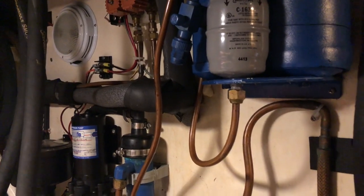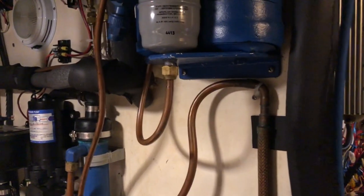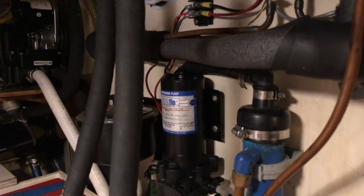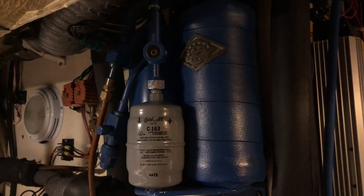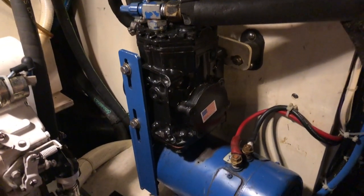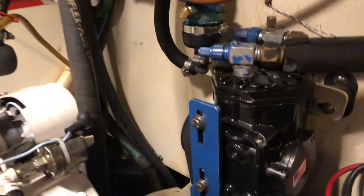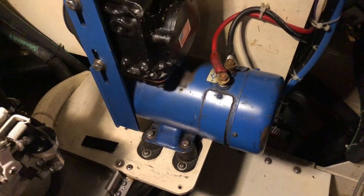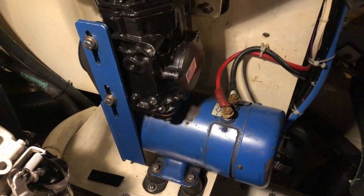The fridge and freezer are the other side of this, very well insulated, so there's no problem with heat from the engine room — and it makes it easy to plumb in the refrigeration system. There's the compressor, the heat exchanger, the pump, the raw water filter, the dryer, and the reservoir — all built in. We also have a spare compressor and a spare motor. It's a holding plate system. Many holding plate systems are belted on the engine — that's a really bad idea. We have a big alternator on the engine making plenty of current, and that drives a big half-horsepower Leeson motor, which drives the compressor. So we're not subjecting the compressor to engine vibration, and we're not junking up the front of the engine.